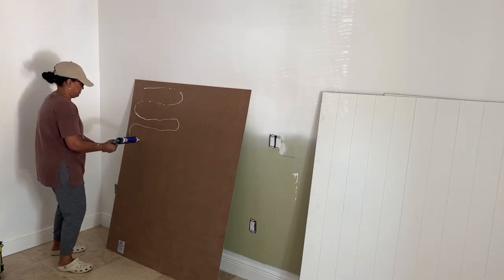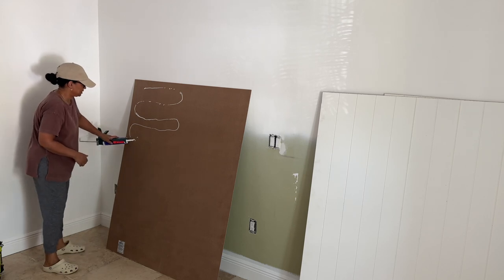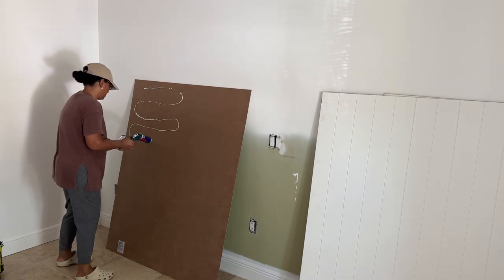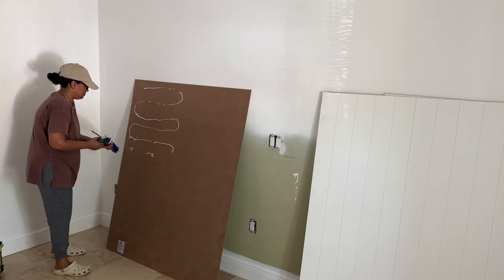I'm using these 4x8 panels I got at Home Depot. I had them cut each one to about 60 inches, which is around 2/3 the height of the wall, including the baseboard. The width of the wall is a little less than 13 feet, so I got 3 panels. For that extra 10 inches or so, I'm going to cut from the excess and make it up.